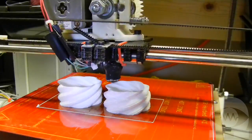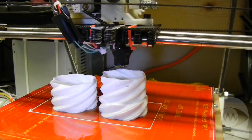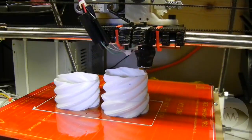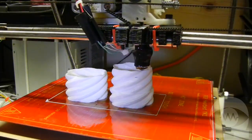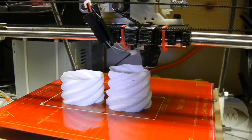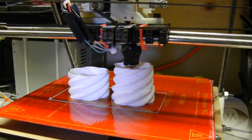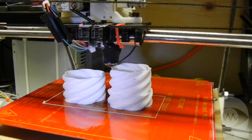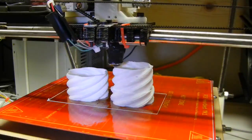We'll skip now to the end of the print. When we have a 3D object model in an STL file, we use a program that virtually slices it into layers. The program I use is called SkeinForge and it slices or skeins the model into layers. When it's done, the result is a G-code file that can be sent directly to the printer's controller. There are several G-code programs and some host software programs have one built in, but most people in the community consider SkeinForge to be the most advanced free program available. Once I got my Prusa built and the basics working, most of the work to make a good print is taking the time to tune my SkeinForge settings to get them just right. Now that I have things set pretty well, I don't need to do very much tweaking to the settings unless I change something big or decide to experiment with something new.